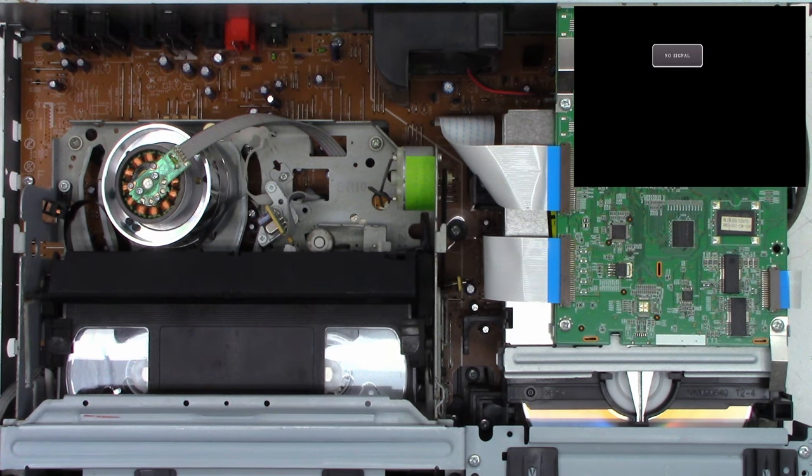And you're probably not going to be able to see this because my hand is going to be in the way. But I have soldered one lead of the capacitor. There it is. I'm so sorry about that. So I've soldered one lead. The other one is just basically sitting there. I'm going to apply solder to the second lead and then apply more solder to the first lead to make a good mechanical bond. Push that down and relieve the stress. So one capacitor has been installed.